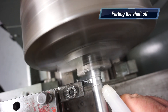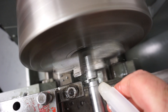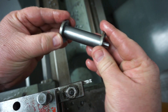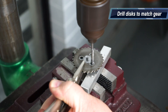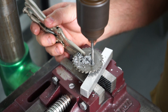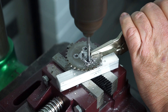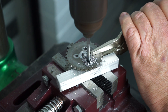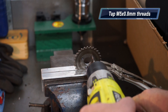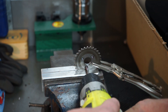I've actually got the cross feed power feeding under its own power, just to part that off. The test fit of the disc looked good - I was happy with that. Now before I can weld, I've got to drill the holes in the disc to match the cog and tap them - M5 I believe - so I can use the original hardware from the engine to mount the gear on the disc. Here I'm using a Sutton tap and popping in to tap those M5 holes.